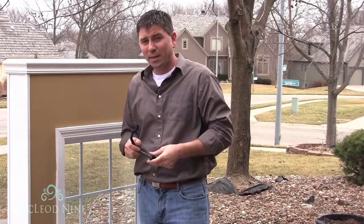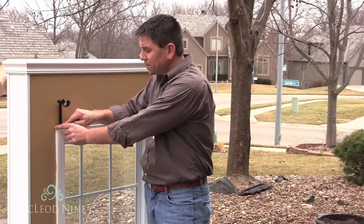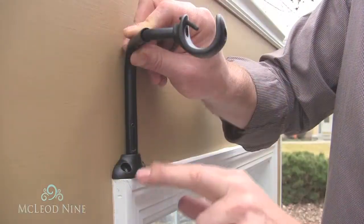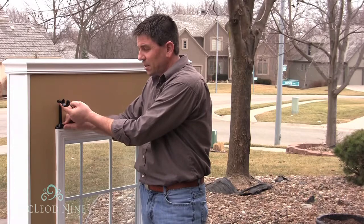And this is important because this means that you no longer need to rely on plastic wall anchors, sheetrock screws, mollies, any sort of sheetrock anchor that's virtually going to come loose at some point if it's not installed 100%. Once this bracket is installed, you've got an inch of adjustability up and down to do any sort of fine tuning that you might need to do. You also have an inch of adjustability in and out with another set screw that's located underneath here.